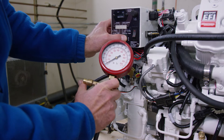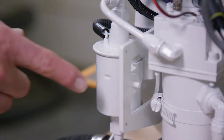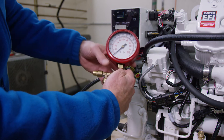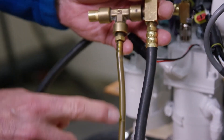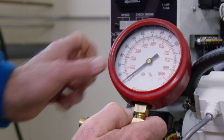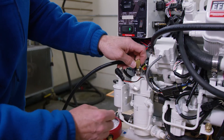Press the stop switch and hold it depressed — this activates the low pressure pump. Observe the fuel flow through the bleed hose. When no air bubbles are seen, release the stop switch to close the bleed valve and observe the fuel pressure, which should typically be 3 to 5 psi.